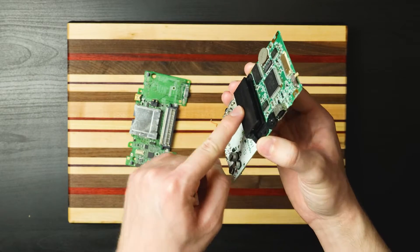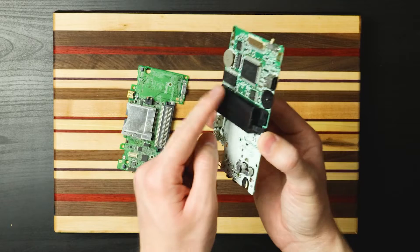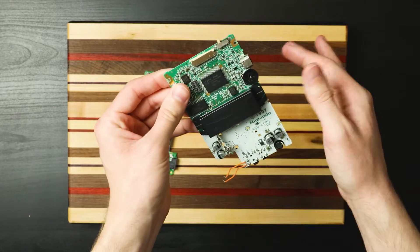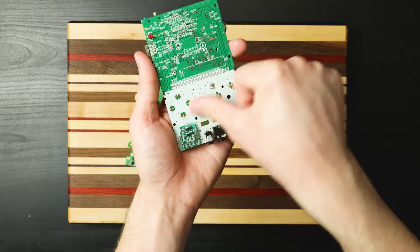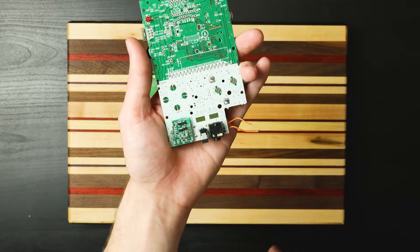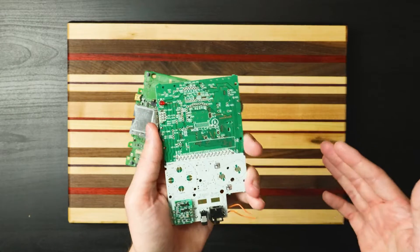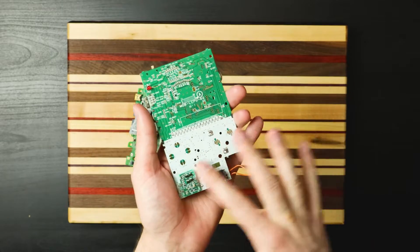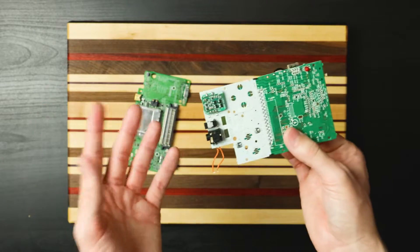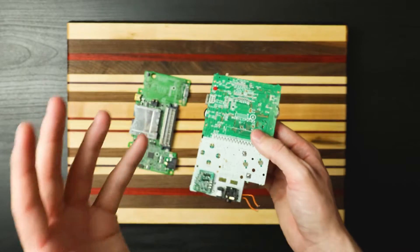If you clean the crap out of your cartridge connector and it still doesn't read games, reflowing the cart slot might help. With an ultrasonic cleaner, this has actually helped my cart slot. Once I'm done reflowing all that solder and fixing anything that needs to be fixed, I like to wipe down the button pads with a paper towel and isopropyl — try and get it shiny. If it's being stubborn, I might use the fiberglass pen, though I'm trying not to do that as much because I'm not sure how much it wears on the pads.